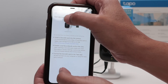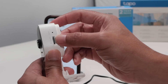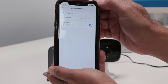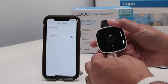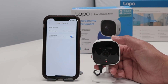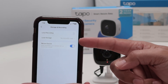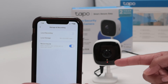It's not detecting the card for some reason. Let me just remove and insert it again. Here is the storage location — micro SD card. For some reason you can't see the SD card. In this case, you can format the SD card on a computer and put it back, or just restart the camera. Let me just restart first — I'll unplug here and plug it back. Sometimes that happens. The camera needs to detect the SD card. You see local recording in local storage showing 'No micro SD card.' You need to see this option available so you can format the SD card because it's the first time the camera is using it. Just restart your camera and wait for the status to change.